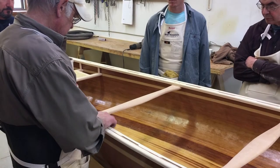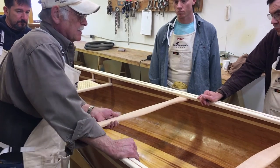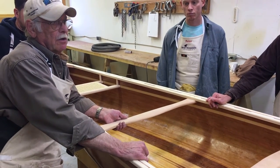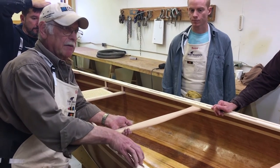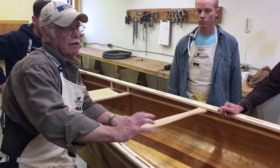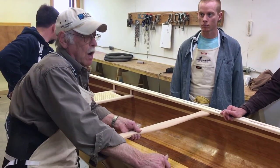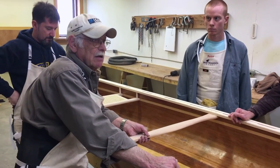So we've got this shape as we've been talking about. I'd suggest you wet that down with water — dampen the surface — and it's going to bring up any bruised grain, so when it dries it can be rough again. Then go over it with 180, maybe 220, just to cut that fuzz off.